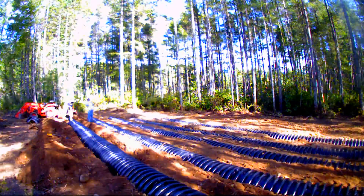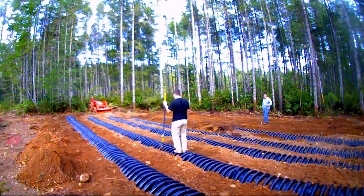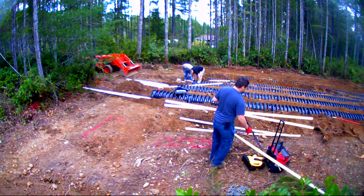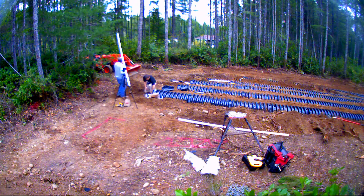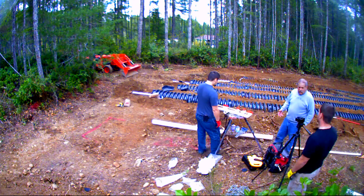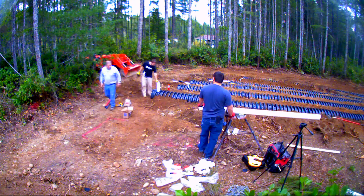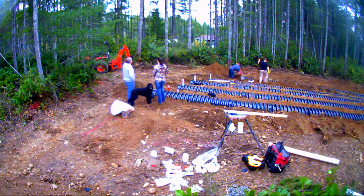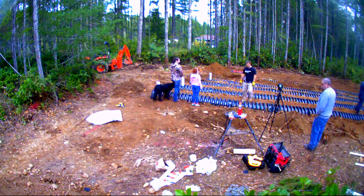He ended up with two hundred and sixty feet if I remember correctly. Now what we're working on here are the inch-and-a-half PVC lines and they have a three-sixteenth inch hole drilled every four feet. We set these in a jig, drilled the holes, brought them back out to the property, glued them together in ten-foot sticks, and then just pushed them down the line from the farthest end all the way down. Then you install 90s and long radius 90s and little caps for the water test, which you'll see later on in the video.